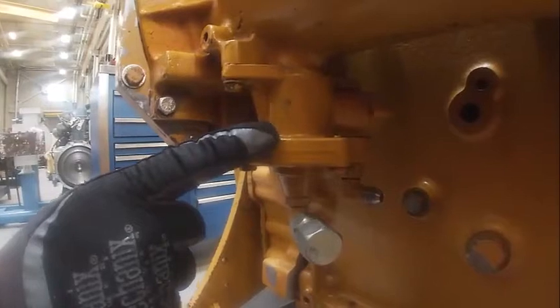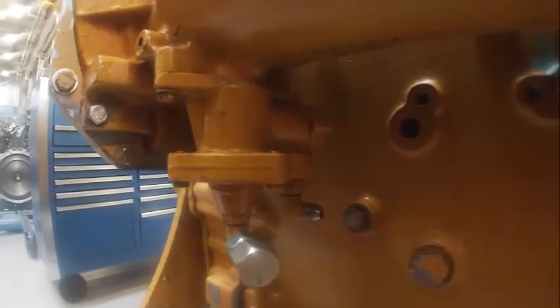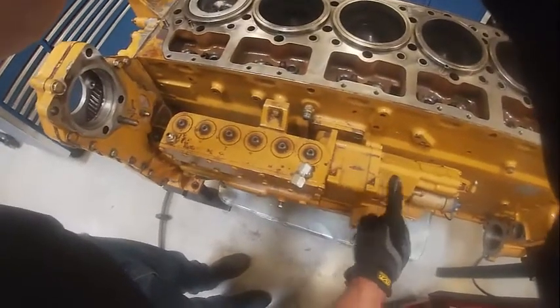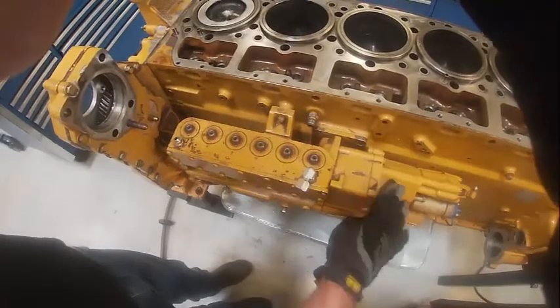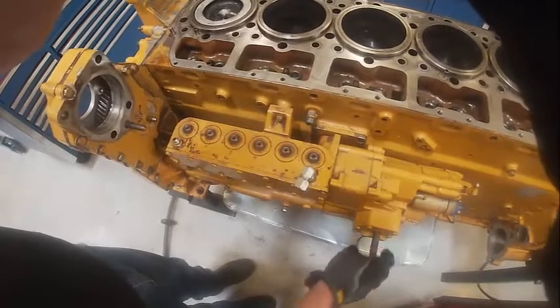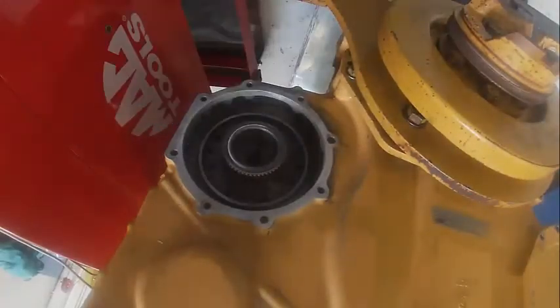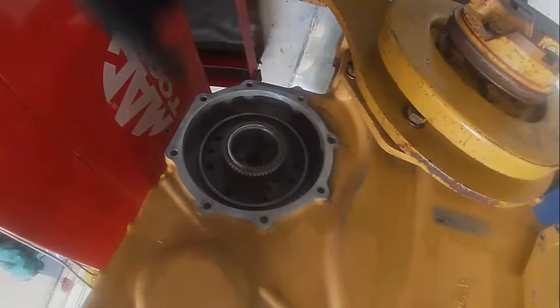You can see right here — T12, 12-pointed headed bolts. This is your transfer pump; it pulls fuel in here from the tank, sends it out to a fuel filter, and from the fuel filter it goes back into the pump. This section right here is the fuel injection pump itself, and this part back here is the governor. There's a shutoff solenoid and an hour meter on it — this is how they read hours on the old ones. The governor's kind of finicky; this is the throttle right here. Some have mechanical shutoff, this one's got an electronic shutoff. This is where the gear train goes — this is the timing advance unit. See how it's geared in there? This gear actually slips, and there are bolts that go through. Once you get it set, you torque those down and it's set.